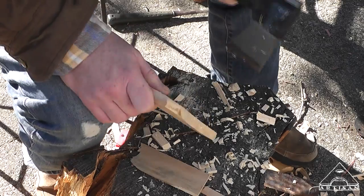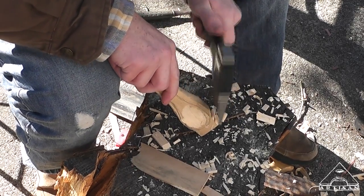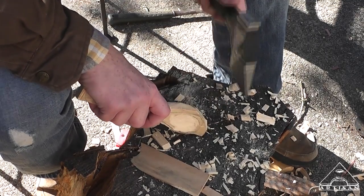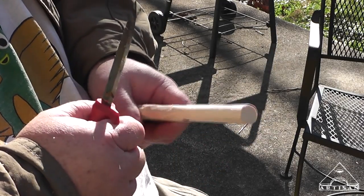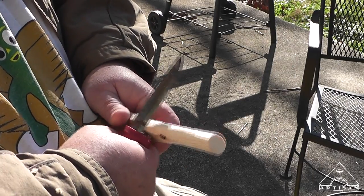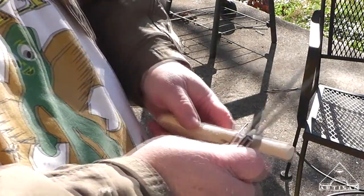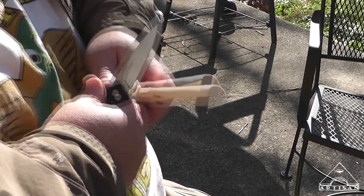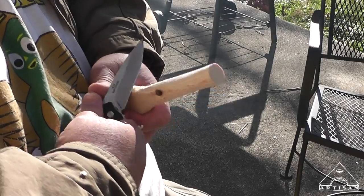Barrett, you can use the knife to do some carving. Don't try to go right to your line with the hatchet — you can't carve with the hatchet, you're just taking off the rough part. You're blocking it in. When looking at this part of the spoon, I need to get this more in and rounded. If you can take your body and brace your hands against your body, you can hold the knife backwards like this. For fine stuff, this knife is a bit dull. The bigger cuts are not too bad — this is my Kershaw. What I need to do is kind of roll it, hold it in, and you can just roll it around.